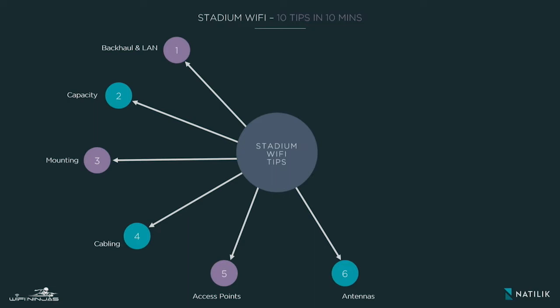A very important point: the antennas. With stadium Wi-Fi, you have to be extremely focused on efficiency and reusing the RF spectrum, making the co-channel interference as minimized as possible. We don't want to cover the entire stadium with every access point — we want to cater only for very limited, small areas where users are, while keeping capacity in mind. Normally we would use high-gain directional antennas — imagine antennas shooting from above, creating a cone of coverage focused on users underneath them without creating too much contention. Sector antennas, patch antennas — some vendors even have dedicated stadium antennas, which would probably be a good idea to use here.